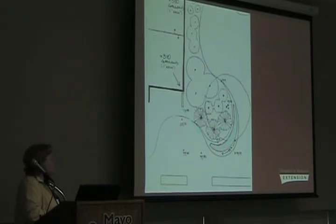Typically in this area you're going to add mulch and plants. The berm area is the yellow area. As the water comes in, it's going to fill up the rain garden and hit this berm so it's not all going to flow across the lawn. And the light green area is where the water is going to come in and be brought into the rain garden.